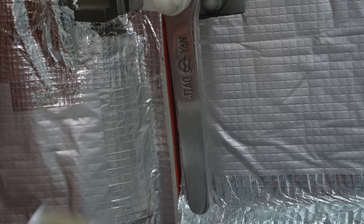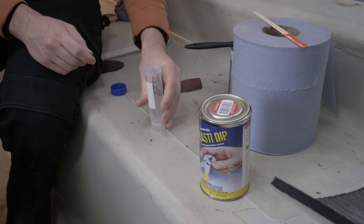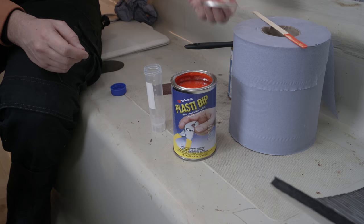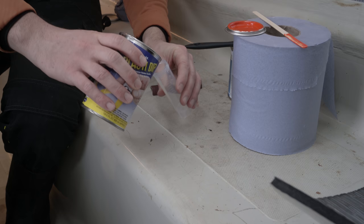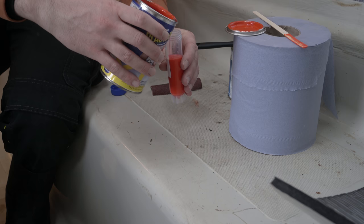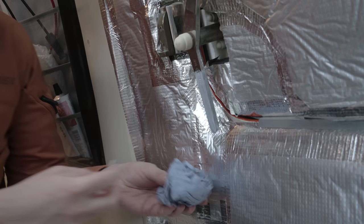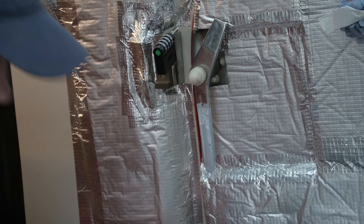I'm using a good all-purpose primer I've been happy with on previous stainless steel jobs. A couple of notes before we turn things orange: firstly, the rubber coating claims you can apply directly, but I felt the additional preparation can't hurt. Second, I could dismantle the latches and do all of this on a work surface, but I want to see if I can get away with it in situ, as they are calibrated just right for my hatches. The dipping pot is too short and wide, so I've found some sample tubes. It's something of a guessing game to work out how much coating is needed — too empty and it will not reach the top of the area already primed; too full and it'll overflow. I'm anticipating a little dripping, so I've deployed strategically located clumps of blue rag. I'm going to neaten up the transition from coating to bare metal later, but on the next one I can run a little masking tape around that location first and save myself the hassle.